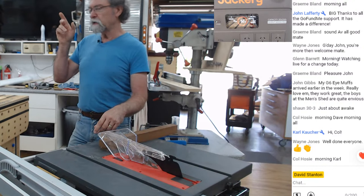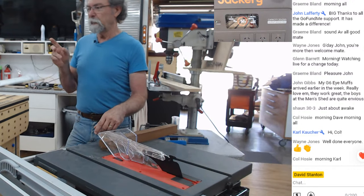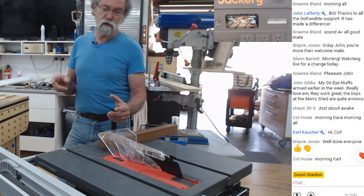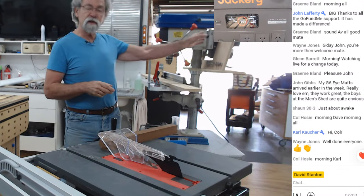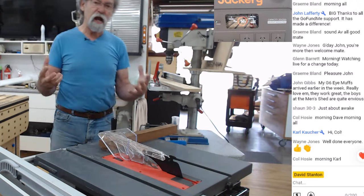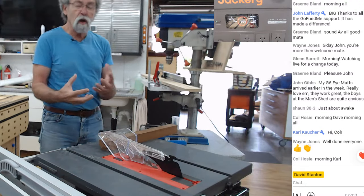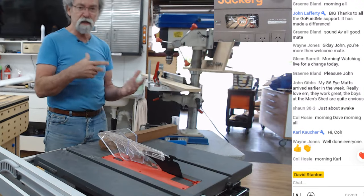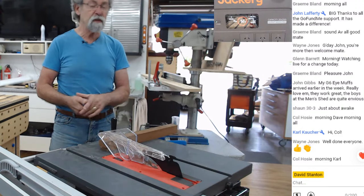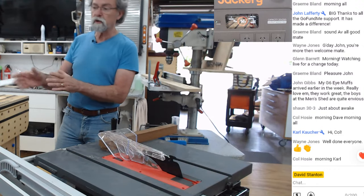So it's also got a 6 kilowatt surge. Now, if I was to have something else like this drill here, that's got an induction motor on it, not a brush motor, it has what's called a startup draw, startup amperage. When I turn it on, it uses a whole lot more power than it does when it's just running and working. The startup is the big thing, like air conditioners. Anyway, I've talked enough about that. We're going to run the whole show on that.